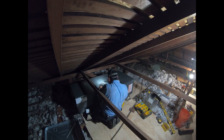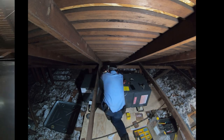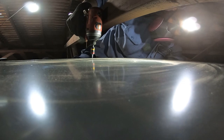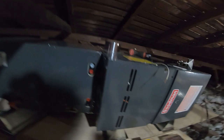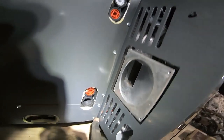For the screws I used inch-and-a-half galvanized sheet metal screws, then mastic tape to seal all the joints. I have the camera mounted on the back of the coil looking forward. This part right here I'm going to pop up and put a screw to hold it tight — this happens sometimes on these Aspen coils.